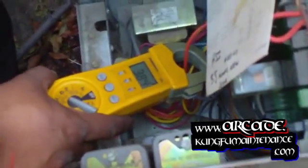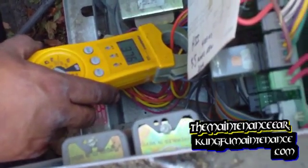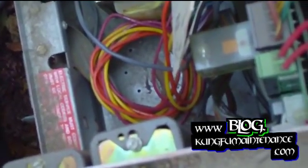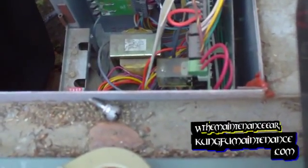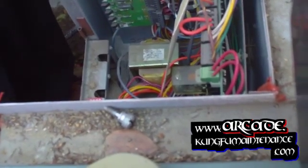This one is drawing high amps — 3.875, 3.7 — that is beautiful. You have until the summer, maybe even longer. If it goes higher than that, like 4.3, that's fantastic. The way I see it, if it starts off really high, you're going to get longevity out of it — a whole year out of it. If it starts off at like 3.5, it works and it's above 3.3, but it's kind of mid-range as far as dependability. When I see 4.1 or 4.3, I feel better — I know it's going to be a reliable igniter and it's going to last a long time.